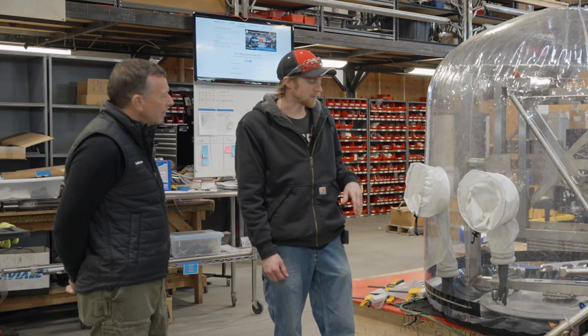Ultimately, one of the key things that happened in our new design: we ended up trying all sorts of reinforcements, then pulling all of those reinforcements back out and just beefing up the tubes in the overall gear. So this is the production gear — we ended up beefing up these tubes because we found that was a better approach than just reinforcing tubes of a similar size. We also did a different welding assembly on the ends because we're trying to optimize the titanium welding approach. The old gear had straps on there for further reinforcement, but our testing found those were not necessary, so we ended up with this nicer machined end on here.